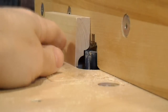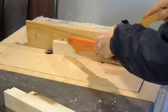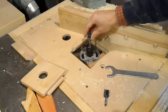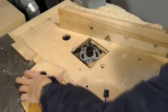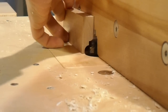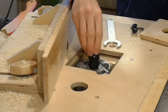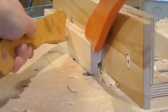I'm going to remove the material in two passes — first backing off the router bit to make a cut, then adjusting it to full depth for a second pass. Then I switch from the straight bit to the round-over bit, and finally switch to the inside round bit, or cove bit. That finishes up the lower molding.